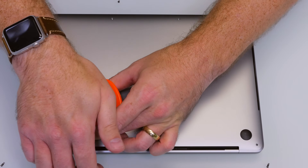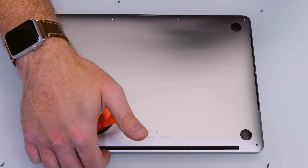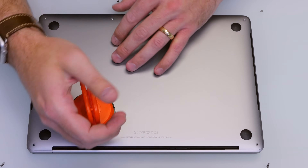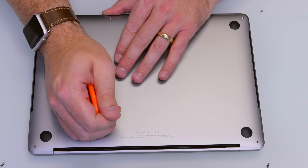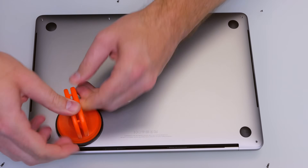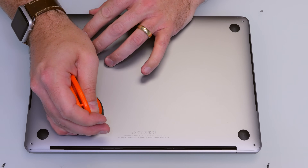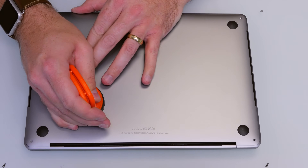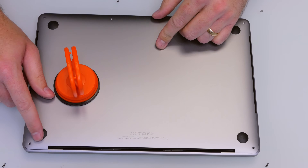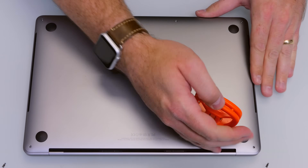On the suction cup, you have to push down a little bit because the aluminum is a semi-porous surface, so it doesn't give a massive grip like glass would. Push down a little bit on the suction cup — not too much, you don't want to damage it. Then hold the bottom and pull down a little bit, and just keep trying that until you get it to move. What you're doing is moving the corner just a millimeter or so — that's all you're trying to do, just to get it to move.